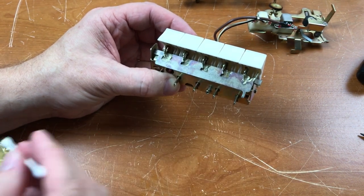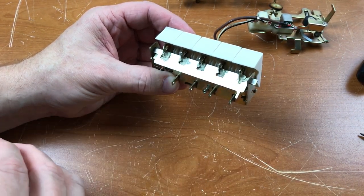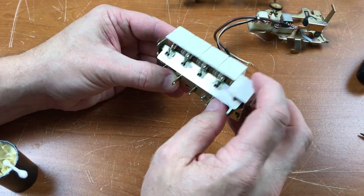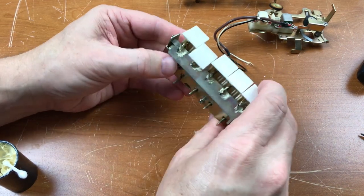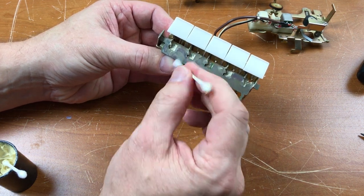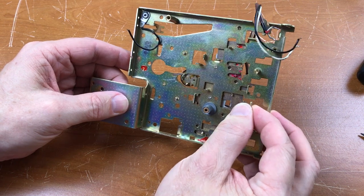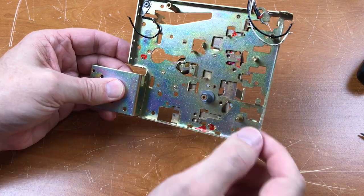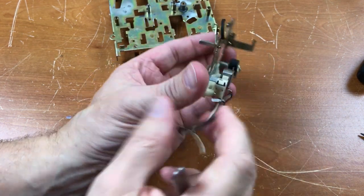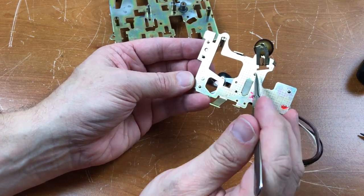In 30 years or so this will dry up, get sticky and stiff, and be a pain to remove — but in the meantime it'll keep the metal parts moving freely. I'll clean up the excess so it doesn't leave a mess. There's a bit of movement here — you can see the places where the metal is contacting. So I'm going to apply a little bit of grease here and here on the underside. This is the contact plate. On this plate you'll see little dents, and on the reverse side these are nubs — little protrusions. This is where the metal-to-metal contact is.